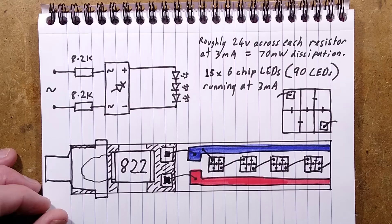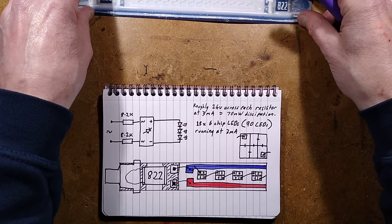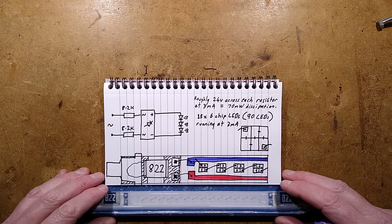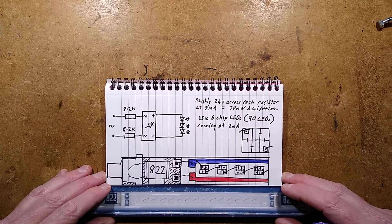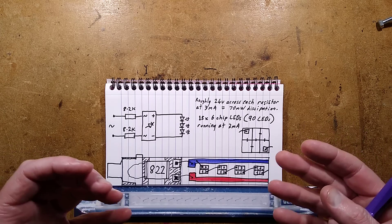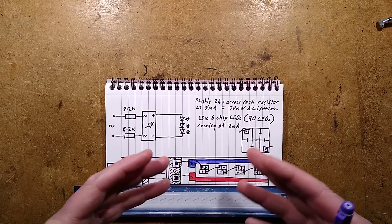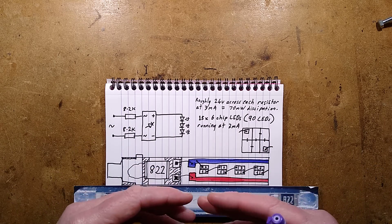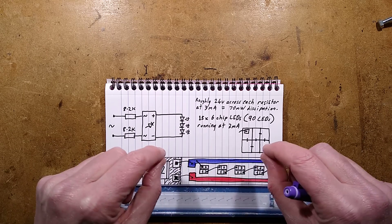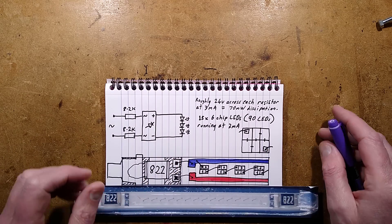It's very impressive - definitely an evolution for the low intensity decorative LEDs. I've ordered more from the same seller on AliExpress in different styles, but there's no guarantee they'll be identical. That's one of the problems - you might order what look like identical bulbs but they aren't. They may be from different vendors, and some may just have a smoking hot resistor in the base and just a smattering of LEDs. Some may even use LEDs as a bridge rectifier, which is a bit naughty. I think some of the bigger filaments do that.